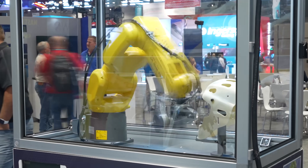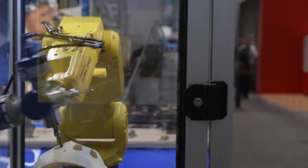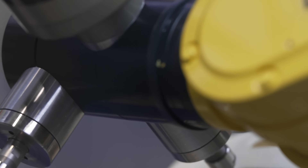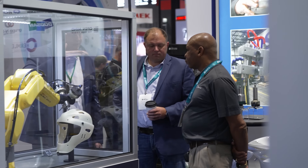Powerful air turbine motors cut at 25 to 65,000 rpm with power up to 1.4 horsepower. Easy to mount with no vibration on your robot arm. You just require 90 PSI with no lubrication and no control system. You can mill 24/7 at high speed with high power for a finer finish.